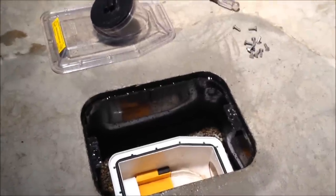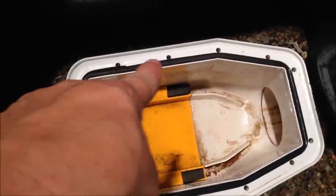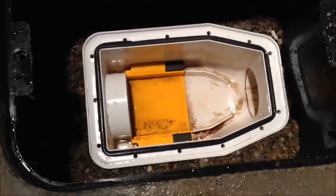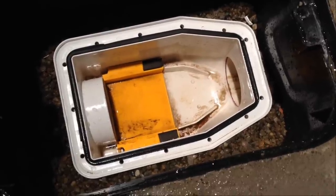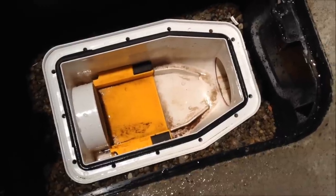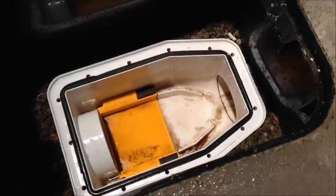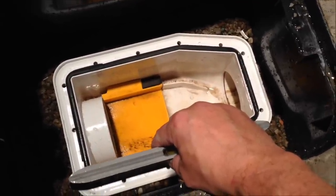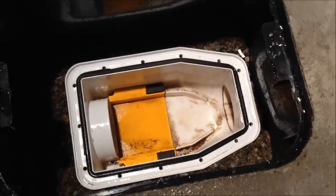I just rinsed off the cover and cleaned it really well, top and bottom. Also inside here you can see some water going down — I drained the sink basin around this. It's imperative that this gasket is clean; it's kind of concave and needs to be cleaned out if it's dirty. There was a little stuff in there and I cleaned it out. We're ready to put this back on and inspect it in the spring, which will be about the six-month interval. Hopefully it won't have any water backflow issues — but if this doesn't do the job, I don't know what else would. It looks like it will work incredibly well. Also I want to point out: earlier in the video when I had my level going across the valve it wasn't level at that time, but I hadn't yet tightened up my straps and leveled it off — it is level now, like it should be. And we're done.